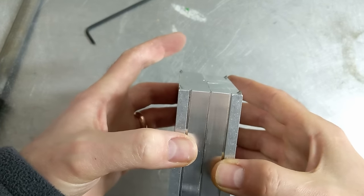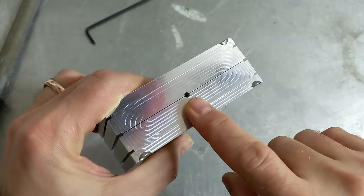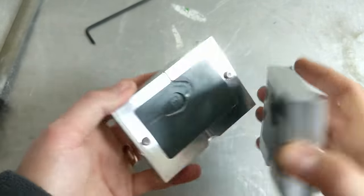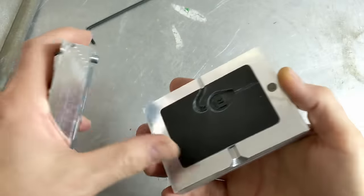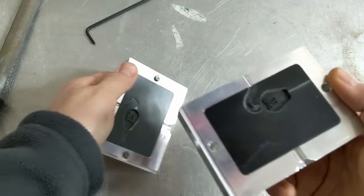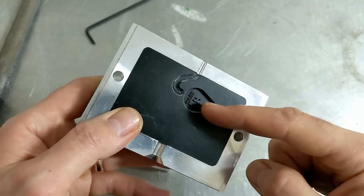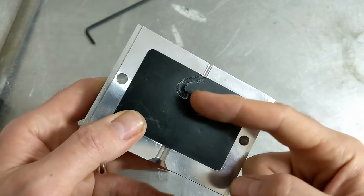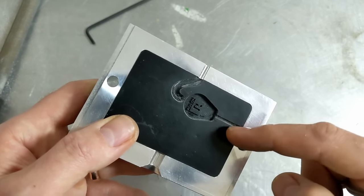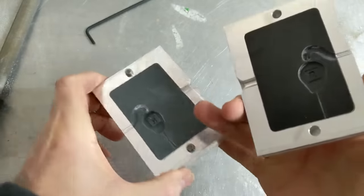So we have our mold. We'll start injecting with some low-temp TPE — thermoplastic elastomer — and see how it flows without lots of flash. If that goes okay, we might try something else. This mold is going to be an overmold onto a brush end. There's going to be an insert here, and once we refine this, we'll mill it out so we can have an insert go in, closing off on the rod and overmolding onto the end of the brush.